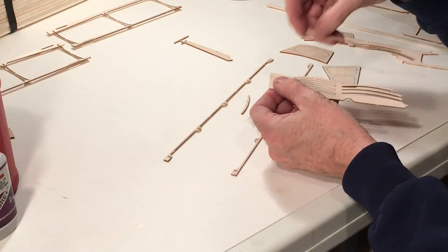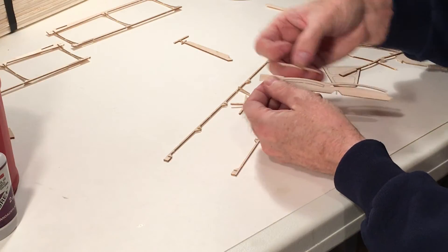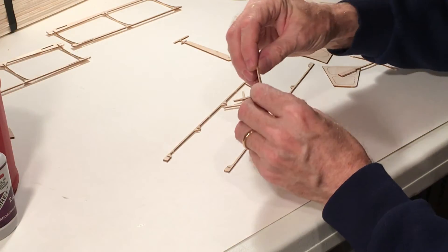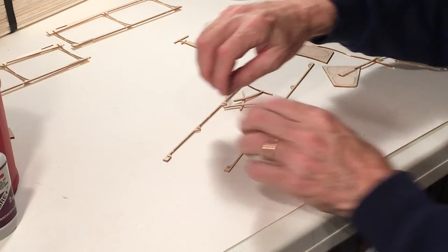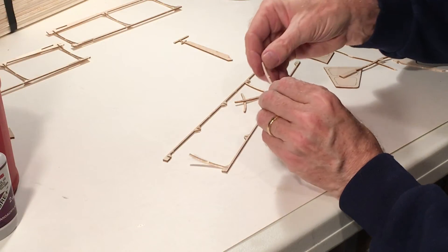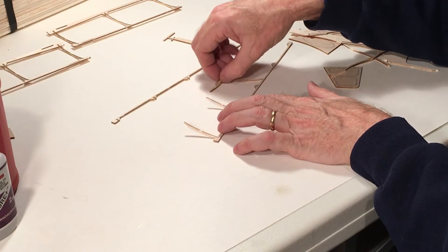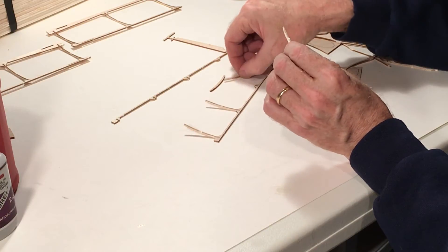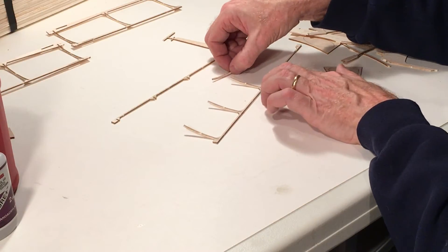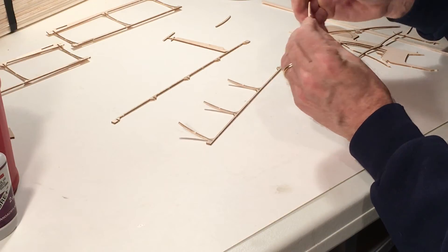You can split this wood to get at the piece — that's not a problem, the piece itself will remain intact. All those ribs look a little bit thick, so I'll squeeze them a little bit and lay them into their spots. If they're too thick, give them a squeeze to get them slightly thinner. If they're too thin, moisten them a little — sometimes just a quick lick — and the wood will swell to the point it will fit. That's proven to be a pretty reliable technique.